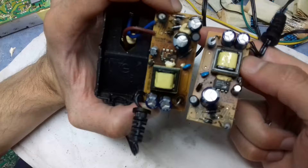The chip acts as a switching transistor. For this kind of adapter I don't think it is worth repairing — first because I couldn't find the chip anywhere. You can also see that there is a blown capacitor on the top side of the board.